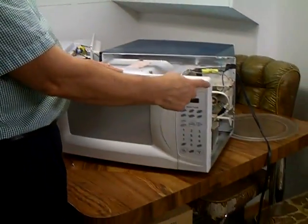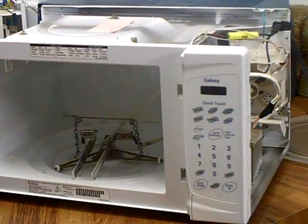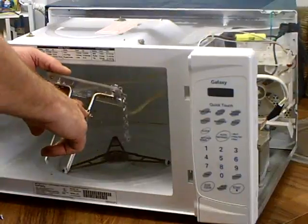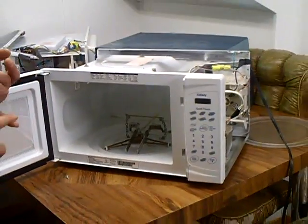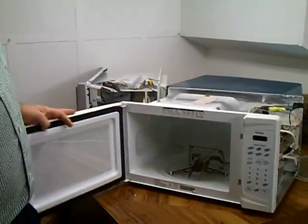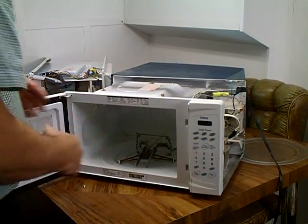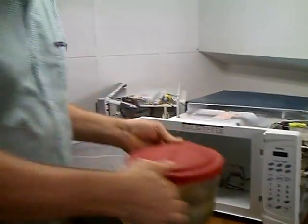I also have an automatic machine. With the automatic one, it has three lights — three little LEDs — and it has the bars and everything. With the automatic one, the temperature sensor goes right on the bar. We don't have to measure the temperature of the water directly because silver is one of the most thermally conductive materials known. We put a thermistor on the bar, run a little wire off to a small computer system that maintains ideal water temperature. It pulse-width modulates the voltage. With the automatic one, you simply close the door, it runs, and when it's done it shuts off automatically. You open the door, push a button on the inside to reset it, take your water out, and pour off the top part. Here we have a batch that's done — you've lost some from evaporation, so we pour it into a bottle and simply refill it with distilled water to begin the next batch.